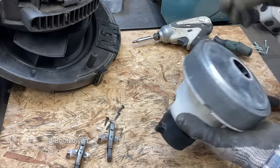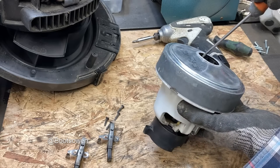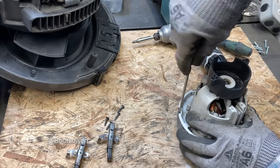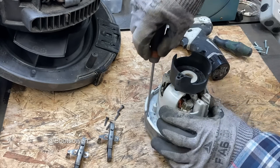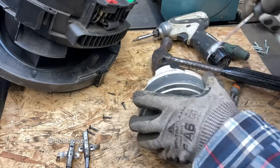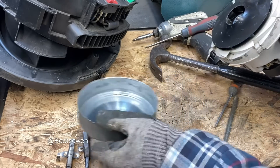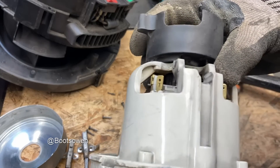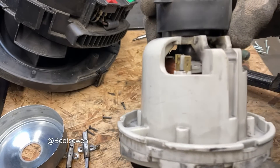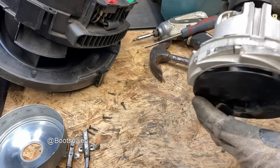These motors are not easy to take apart, so how can we check if it's spinning? It is spinning freely just on the end there. Burnt out rotor — is that the answer? If I prise that off on two sides, we can try and tap it off. If you can get in there, can we see that pink on the commutator? That's just cooked — you go around with pink on one side and brown on the other. It's just cooked. I don't think there's much to do with it. I don't know why that would happen. Like a dud armature? Dud winding? It shouldn't happen, really.